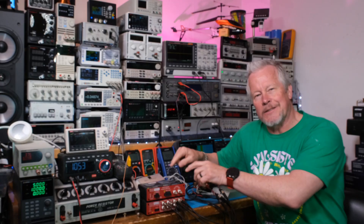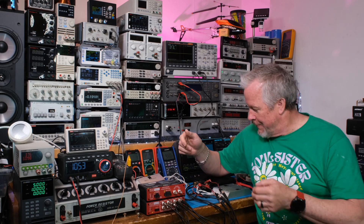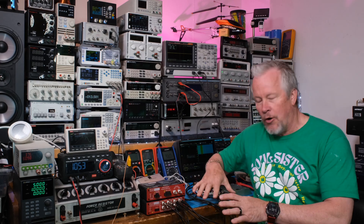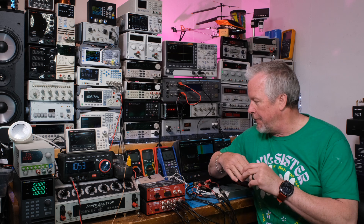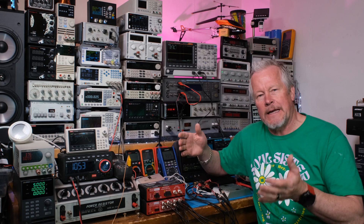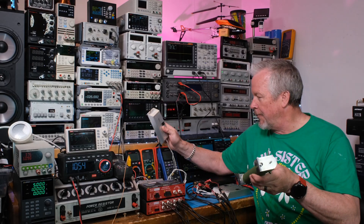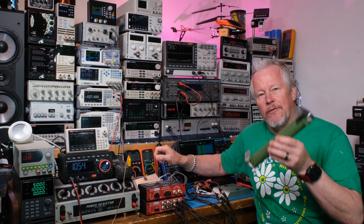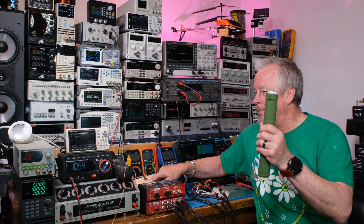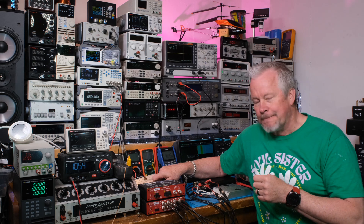That comparison will be the next video. In doing past tests, I've tested a bunch of cables, power cables, resistors, all kinds of things. These green resistors actually perform better at high frequencies than the silver ones — they're more non-inductive. After this test, I think I'm going to build a load bank with more of the green ones.